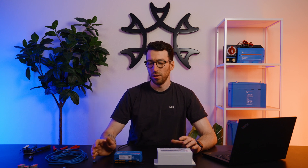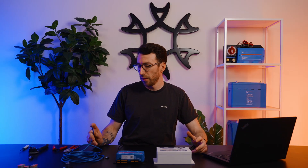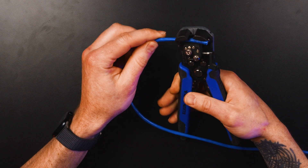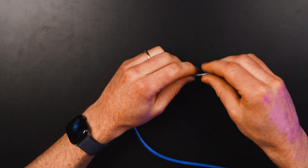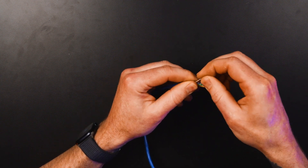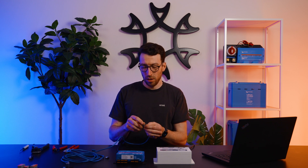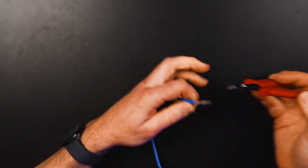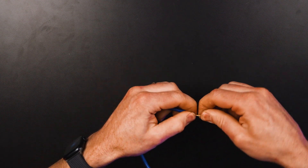When integrating the WakeSpeed with the Garmin core system, we'll use the second CAN bus port on the WakeSpeed. It will connect to the RVC network using an adapted RJ45 cable that has a four-pin male connector at the end. To make this cable, take a standard RJ45 Victron cable with the connecting end cut off, strip about two inches of insulation, and inside you'll find four pairs of twisted cable: orange and white, green and white, blue and white, and brown and white. For this cable we will only utilize the orange and white pair, so cut off the other three pairs and untwist this pair.